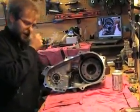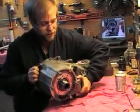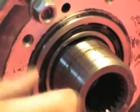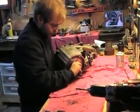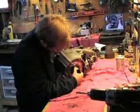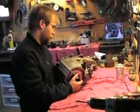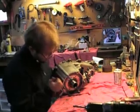If you've got it all the way in, you'll know. There's a snap ring that goes right there, and you have to be able to fully seat the snap ring in this groove on this side to hold this assembly in place. Spin it slowly — feels good. A little crunchy noise because the bearings are a little dry, and I'm not going to spin them a whole bunch. I will pre-lube everything with ATF before I fire it up. That's it for the planetary.